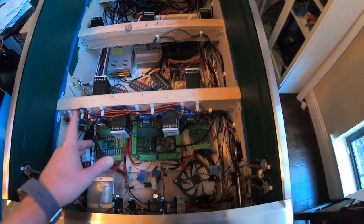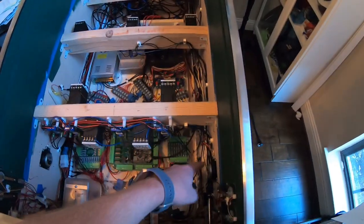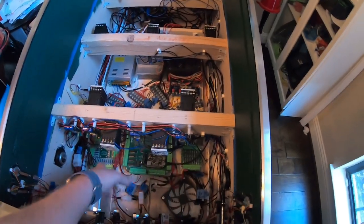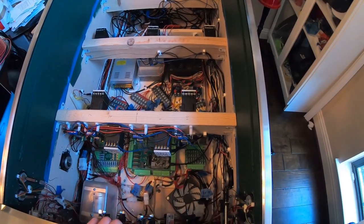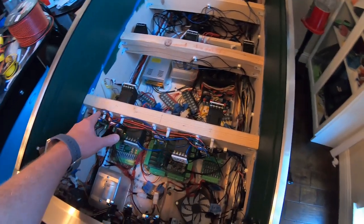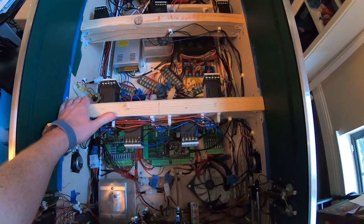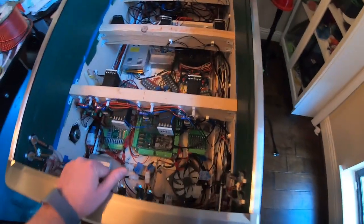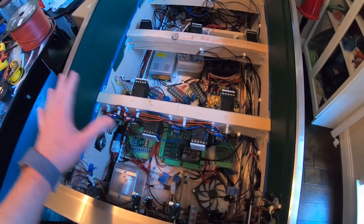The only problem is when I turn the amps on, they get this hum from the speakers and the exciters, and even the subwoofer pops a little bit. And there's nothing connected to them except the cord, so it might need a ground loop thing or something. I don't know. The tilt bob has a pretty high resistance, so I don't know what that is. It's making contact and everything. It's just like 3 or 4 ohms versus less than one for everything else. It's more or less a dead short, but it all works, which is absolutely amazing.